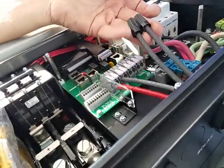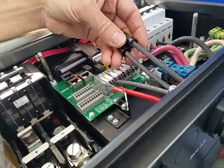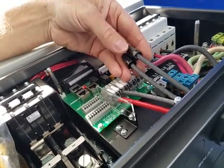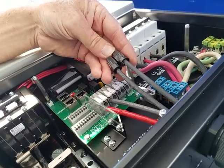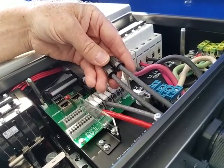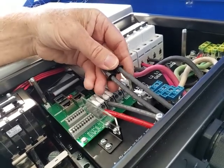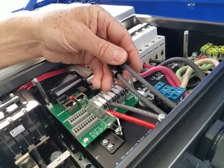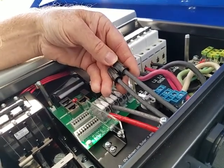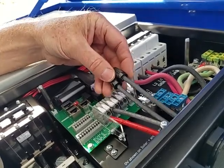So we could take some legacy modules that you have now, and we could run them all the way up to the maximum voltage that you'd want to have here. Your open circuit voltage would be around 450 volts. But I suspect that any legacy modules you have laying around that are 100 watt, 200 watt panels are probably going to be in the neighborhood of 20 to 30 volts. So you can get quite a few modules before you get up to the 450.